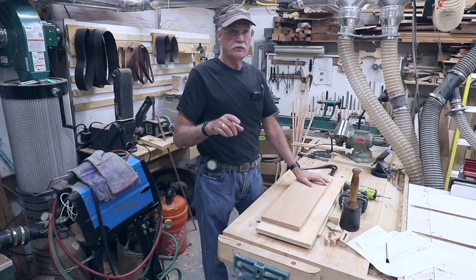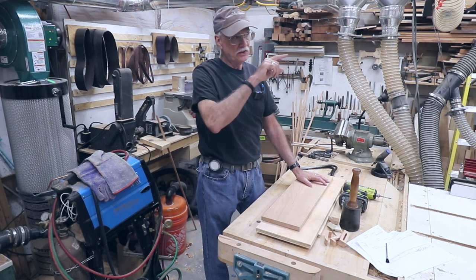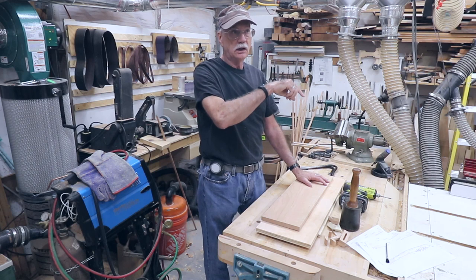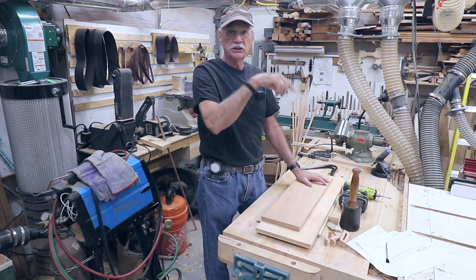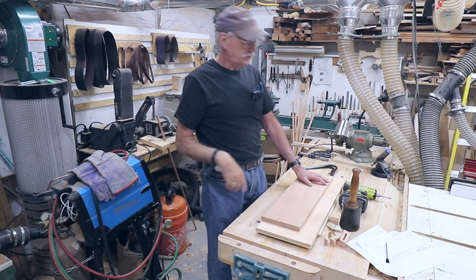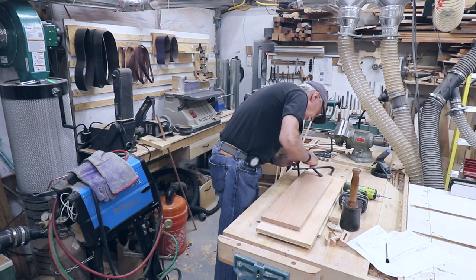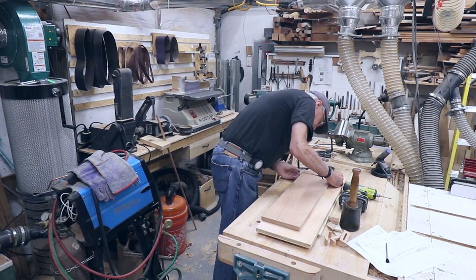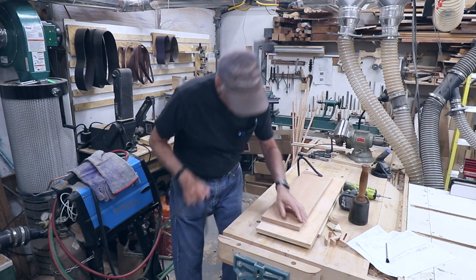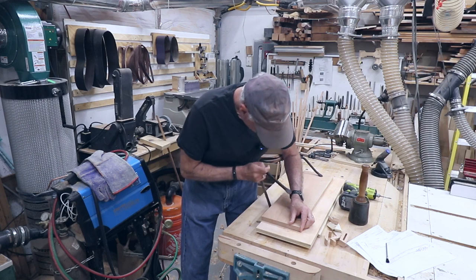Oh, one thing I forgot to mention. I added a 16th of an inch to the quarter inch distance all the way around. So I hopefully get a 16th of an inch reveal or gap around each front, so it doesn't jam when the weather changes, stuff like that. So that's right there. Give it a tap. And this one, there we go. Give it a tap.